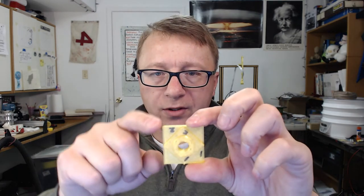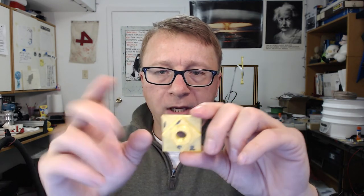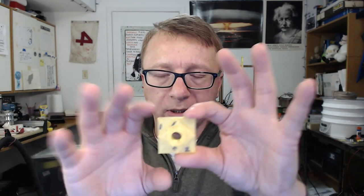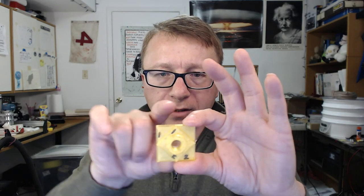Likewise, on the corners, all four corners are rounded over. So if you measure including clamping it in the corners, it would be a little bit larger than in the center. These tests turned out kind of what I was expecting — I'm used to things printing slightly undersized. To compare and contrast the PETG, I printed the circle-diamond-square test in regular PLA — this happens to be Inland black PLA.